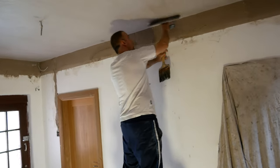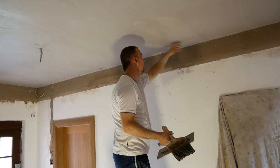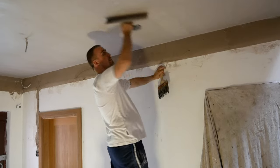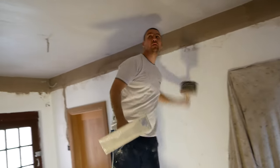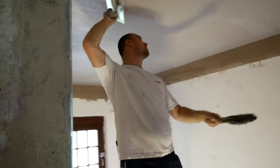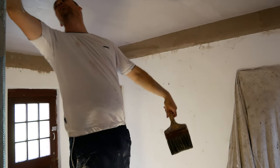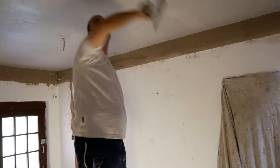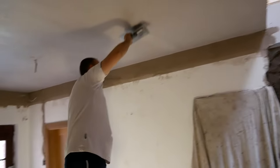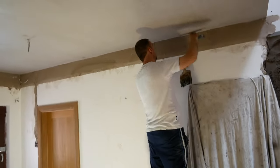So again, timings on the plaster, for me to turn around and say, oh, I put on my first coat and then I washed out and I mixed another bit 15 minutes later, put on my second coat, and then I troweled it in straight away, and then let it sit 20 minutes, then I troweled it again. They'll always just be approximate timings, because like I say, the weather, temperature and the suction of the background, everything's going to have different effects on the plaster. Again, it's something you only really gain by knowledge of actually doing it.